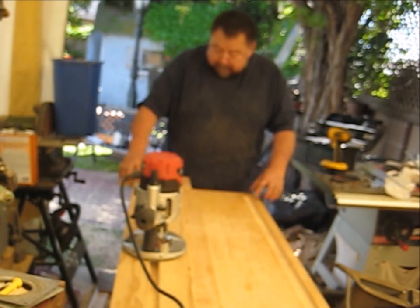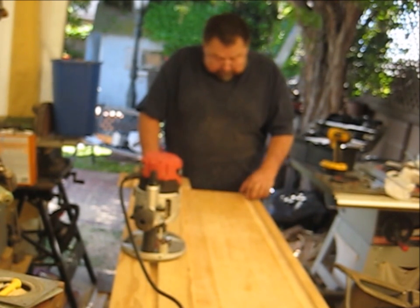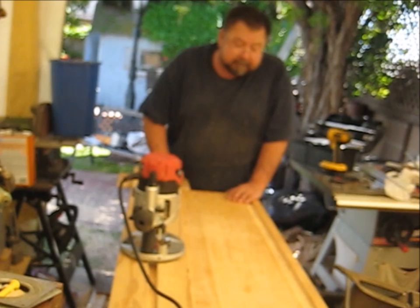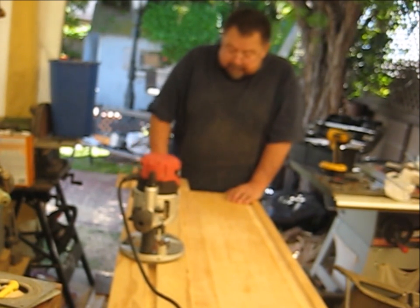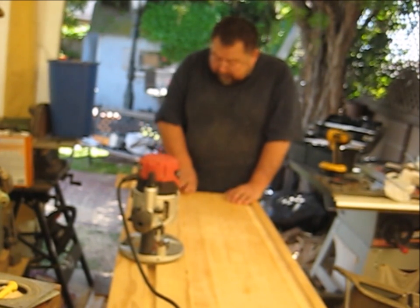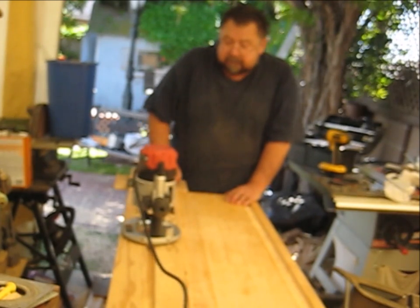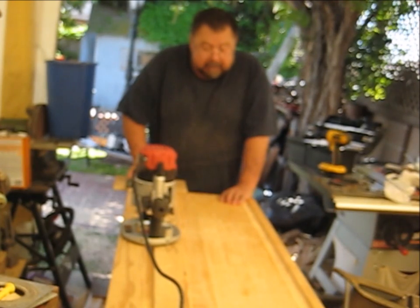And out here, when I put the cross pieces, I'm going to do the same thing. I'm going to put the screws inside the channel where the overlay is going to cover it. So no screw holes are going to be shown. And it holds it a lot better than the clamp. You cannot clamp it where the router is going to come in, so you're restricted even more.